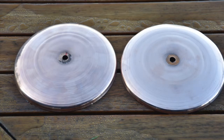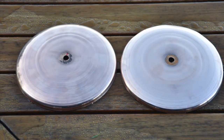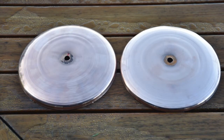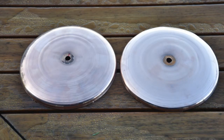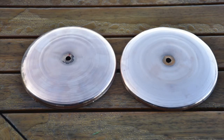For the Hero steam engine, I had to give up on doing completely spherical objects because I couldn't get the copper to wrap into a hemisphere. I did manage to spin a lip on the edge of these to wrap around the edge of the vertical walls on a cylindrical tank, and to achieve this I annealed the copper.